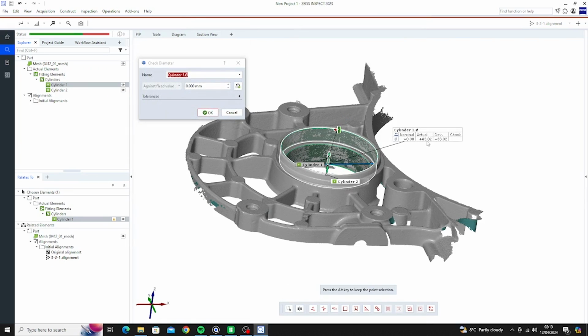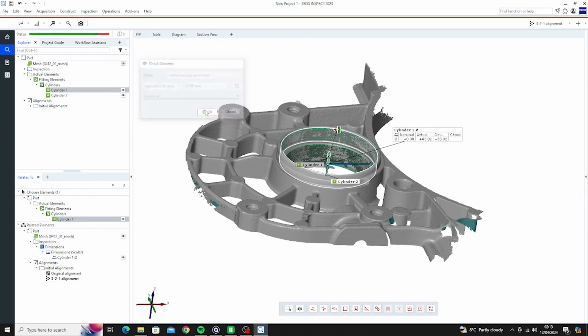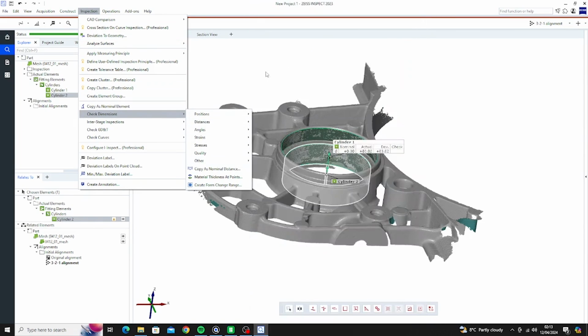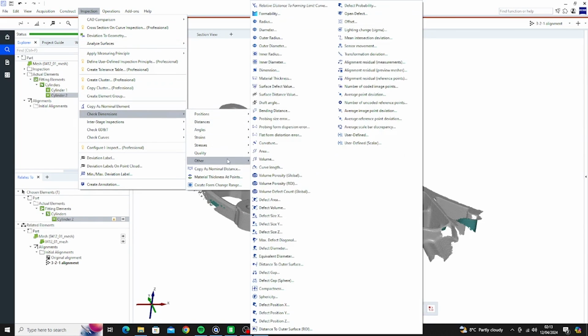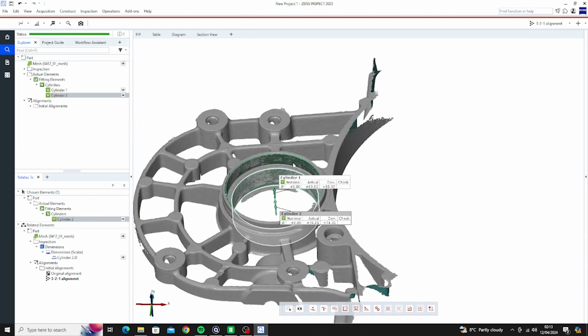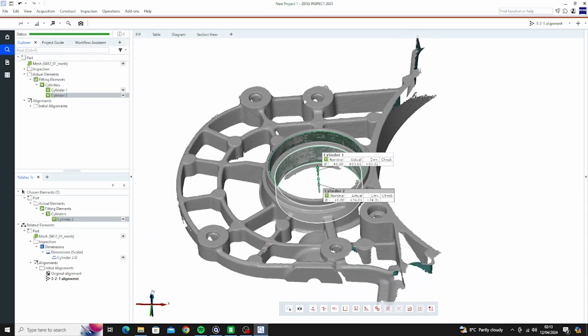Now, you can see there that's 0.02 millimeters. So, not even a foul out on that. For consumer grade, couple £100 scanner, that is absolutely perfect. We'll just check the other one. I'd hope it would be about the same. Even better, 74.01. So we know that that scan now is good to use, very accurate.